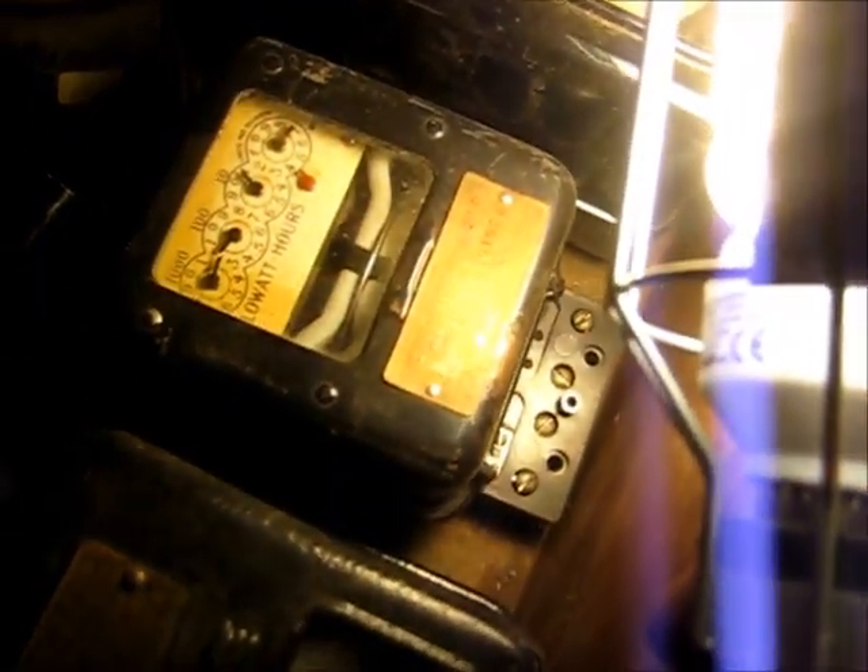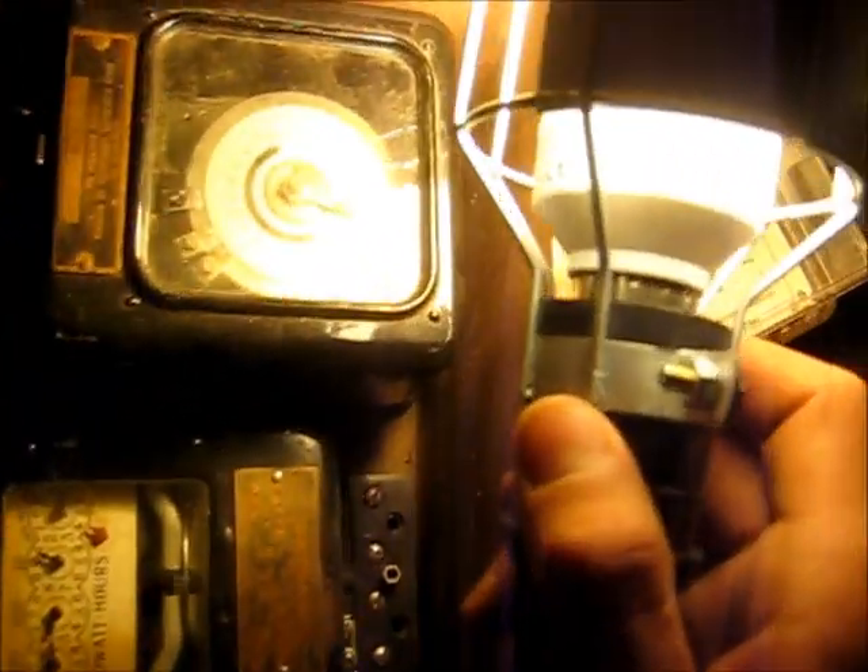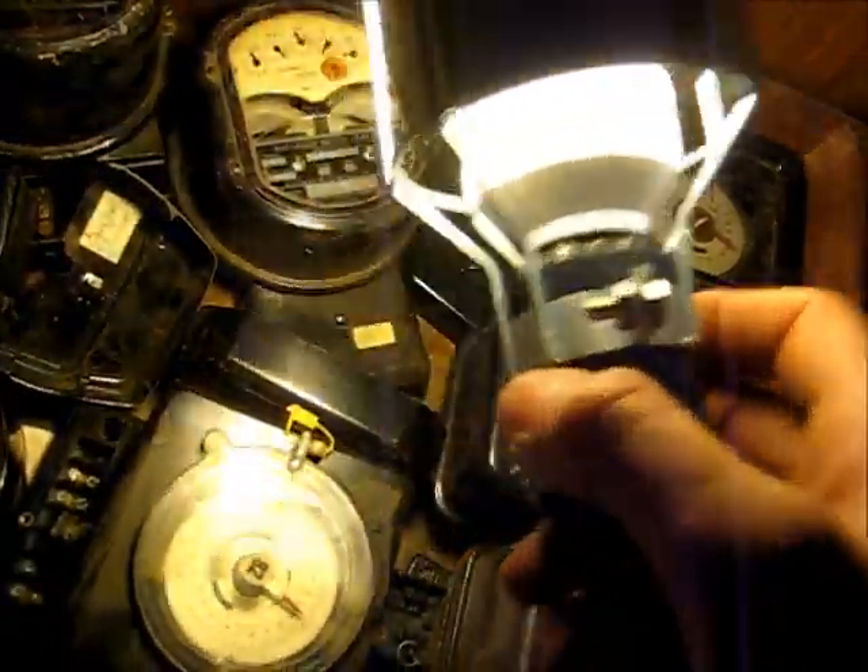Could be wrong. This one here is an Electricity Meter Manufacturing Co Ltd — so it's an EMCO. A very, very early EMCO, prior to the modern EMCO shape — back when they were first established. That one I'm not sure about; it's a time switch, I think that might be a Landis & Gyr. They're all completely intact. Looking at these meters, I've got some dual-rate meters. I've got a dual-rate Landis & Gyr with horizontal numbers that move that way — number wheels that move horizontally.